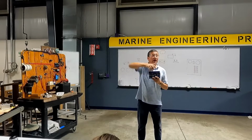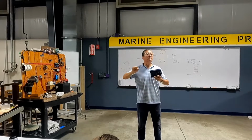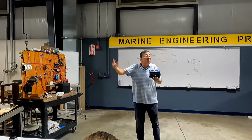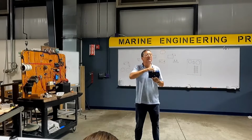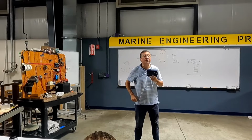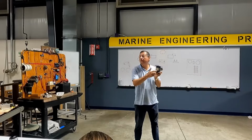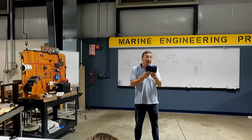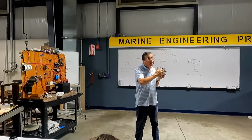Both alternators are charging, input and input, and both battery banks are fully charged, maximum charge. What happens if I need to run the engines more? What happens with the amount of power entering here? If the battery banks are fully charged, what happens? It turns into heat. It's dissipated by heat. Anybody follow me? This element dissipates the excess of power by heat.